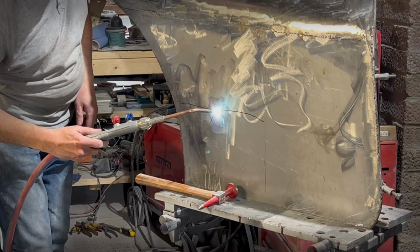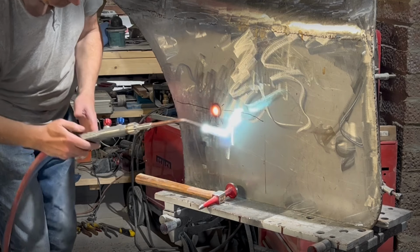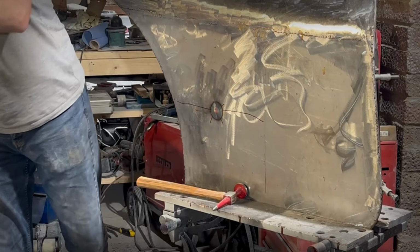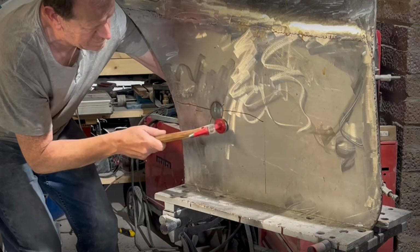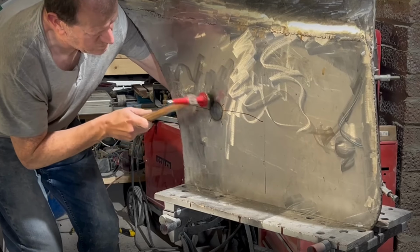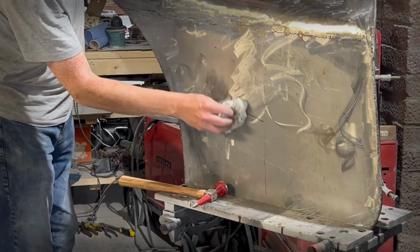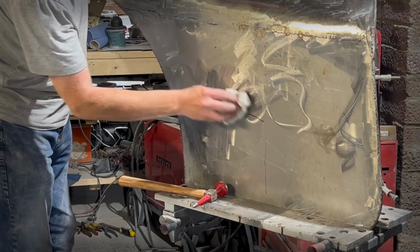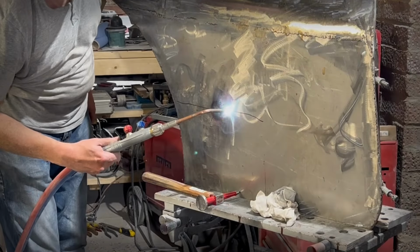So here's the detail on how heat shrinking is done. The first thing is you get your gas welder. Theoretically you can do this with a gas blow lamp, but in my experience you end up getting the metal generally too hot, and it stretches too much before you get a single red hot spot. Gas welding allows you to get intense heat into a very specific point. When it's red hot, you then hit it very hard with the sharp point of the hammer, and this puts a deep dent into the metal. Then, with the dolly pressed hard onto the back of the dent, you hit around it with the flat end of the hammer to reduce the dent. This is called off-dolly hammering. And with the dent smoothed down, you then quench the metal quickly with a damp rag. This causes a rapid contraction of the metal and hopefully tightens the surface.